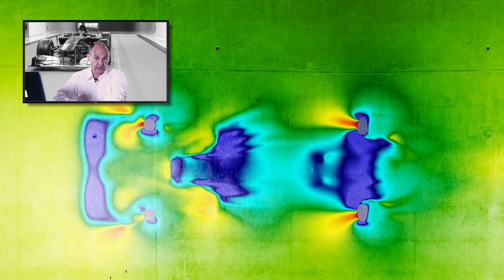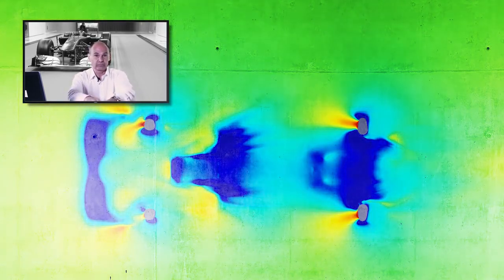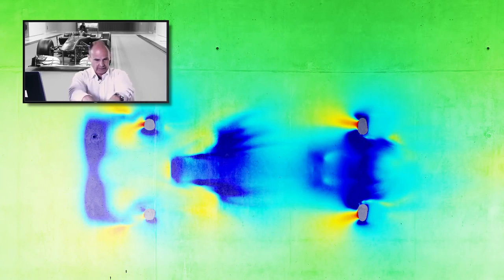So you apply the suction where the front wing is, and nowadays we just use CFD to tell us what the map is of pressure on the surface that we're running on. But in the past we would, through experimentation and logic and a bit of aerodynamic knowledge, work out that most of it will be where the front wing is, then you'll have other suction where the diffuser is. And so we then would regulate boxes underneath the belt to control where the suction was.